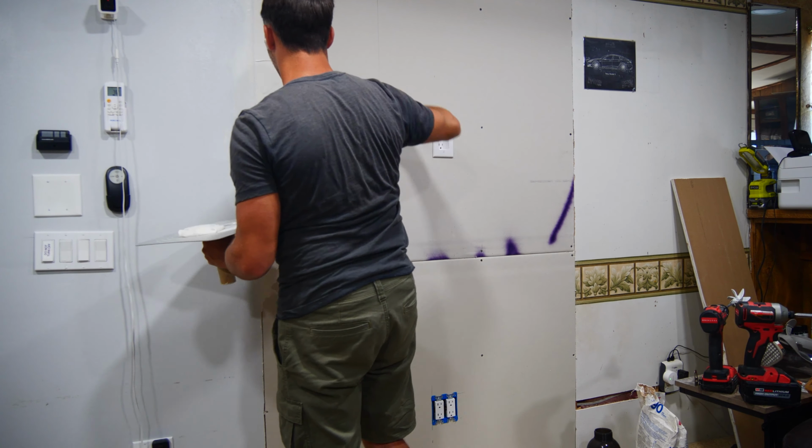When it comes to wall texture spray, or really any spray cans that you ever use, it's always best practice to soak the can in hot water for about 5 minutes before use. Wall texture spray really benefits from this because if the contents of the can are under about 70 degrees or so, it sprays notably blotchier and looks terrible.